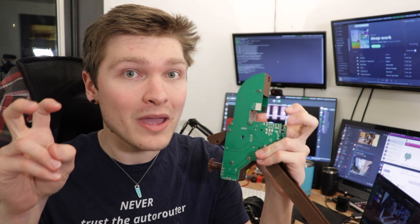Now, the correct way to do this — it's the correct way — is to come up with a custom protocol to talk to the feeders and have bi-directional communication and that whole rigmarole. That is still very much in development and there's a bunch of people in the Discord working on making that happen. In the meantime, I'm going to do a bit of a bodge to try and make this still work so I can test running multi-feeder jobs even before the RS-485 stuff is all buttoned up.